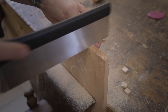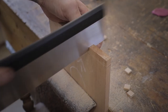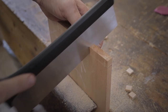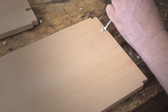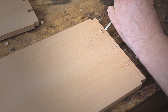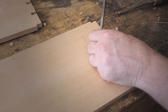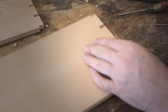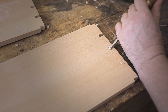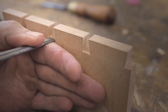To ensure that the chest is going to be a robust build, I decided to make each joint a dovetail joint. It's going to protrude a little bit outside so you can actually see the dovetail sticking out. In this day and age you actually want to show your dovetails, especially if they're cut by hand like this. After chopping out the waste, the last part is basically to pare between each tail just to make sure it's nice and flush.